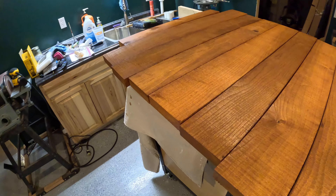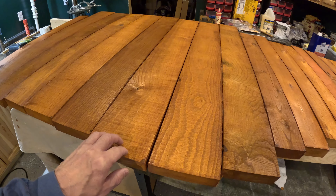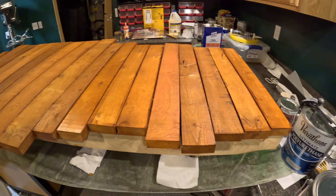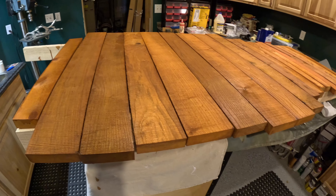Hopefully you enjoyed today's video, and if you have any suggestions for improvements on the design, let me know. I started by staining these ash boards and cutting them to length. They're two-by-sixes — these are either 43 or 44 inches, the cross pieces. I'll put a list of the dimensions so if anybody wants to build one similarly, you'll have it. I'm going to do a little overkill here — I'm going to be bolting these together for the most part, with some screws based on the orientation of the boards.